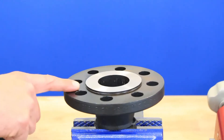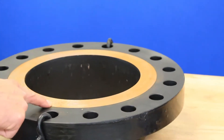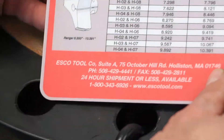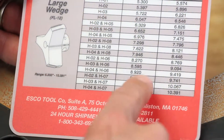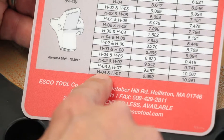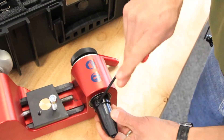Now we will show the setup and facing process on a 10-inch flange. First steps for this process are the same as discussed in the first example: measure the ID of the flange and consult your chart for tooling configurations. In this case we will be using H4 clamp ribs, H7 pads, as well as a large wedge and associated draw rod and actuator.